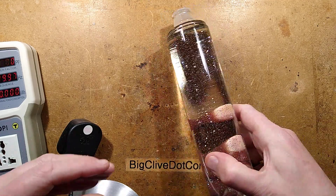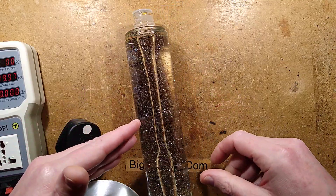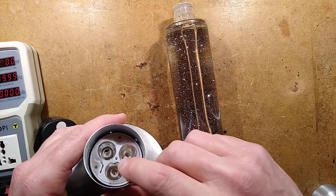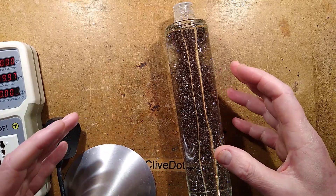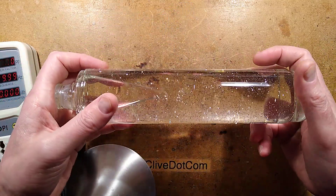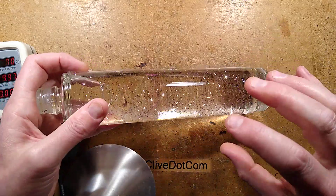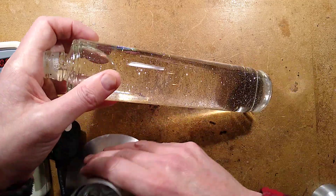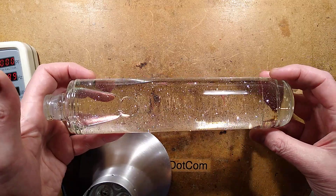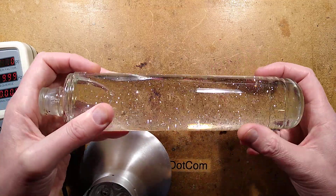Here is the glitter lamp in question. I've just realised that this has been running 24/7 for 8 years — 8 years continuously — so it's not surprising the lamp has degraded. I'm surprised it's not exploded, because that's how these often fail. Anyway, this is based on calcium nitrate, it was an original glitter lamp in this vial. I filtered it, removed the original chunky glitter, and replaced it with Rosco Scenic glitter, which is incredibly precise optically.